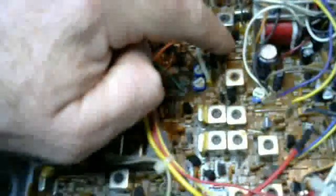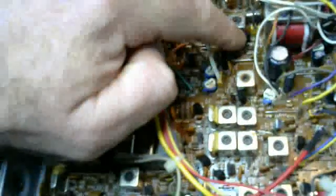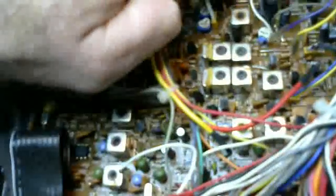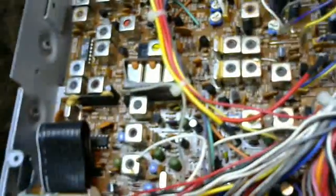There's two resistors changed over here in the receive to increase the bias voltage on the base of the first stage RF amplifier and up here to the receive mixer. On this style board, I don't use a 2.2K. I use the, there's a 10K resistor. It goes in place of, I believe it's a 1K right there, and over here on the receive mixer, R54 has a 22K resistor added.